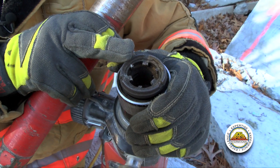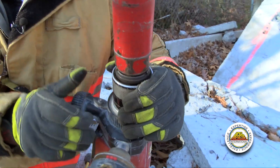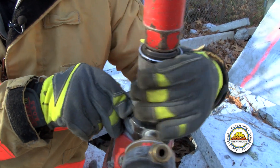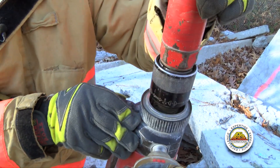You can see the locking pins release from the inside. Then all I'm going to do is line up the grooves into the slot. I'm going to release the locking collar and spin it. When I spin it, it will bring the locking collar up until it's tight, and now I know that I'm locked in.